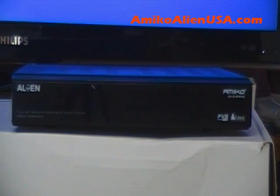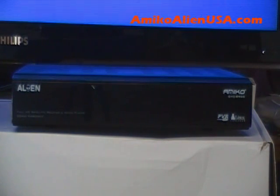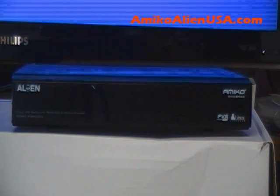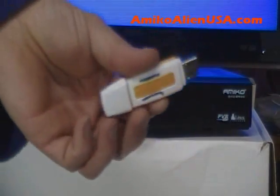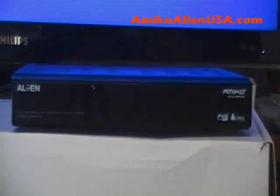You're going to want to get a Kingston USB flash drive and format it to FAT32. From the European forums and from trying a bunch, these devices are very picky but they like Kingstons — others might work but Kingston's a safe bet. Your Enigma 2 image, when you download and uncompress it, will have a folder called 'enigma2'. Copy that folder and its contents to the root of your flash drive — should be about two files: the image and something else inside that enigma2 folder.